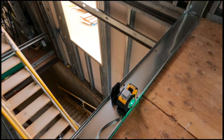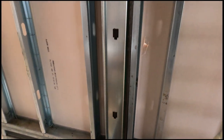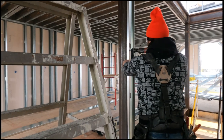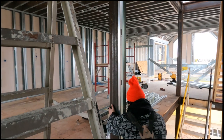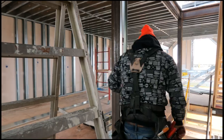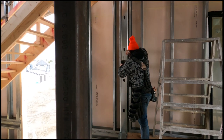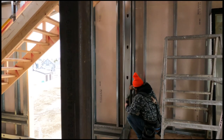We use a combination of lasers — pin lasers and line lasers — to be an effective framer. You should have two pin lasers or one line laser at minimum. On the column studs here I'm going to shoot one pin in the center on six-inch or smaller, every two feet. On eight-inch like exterior heavy-gauge walls, I'm going to stagger those pins every two feet. I'm not going to put more in — every two feet will be strong enough, especially when it's eight-inch heavy gauge.